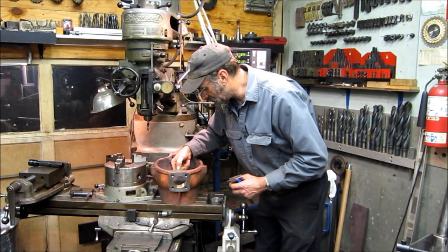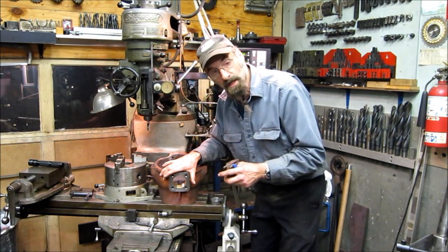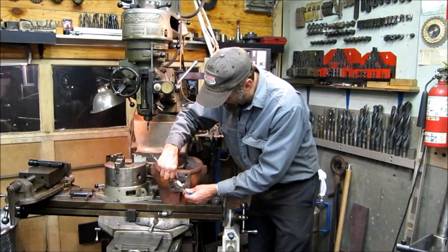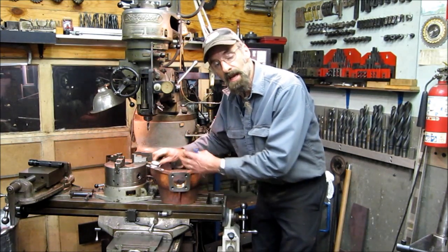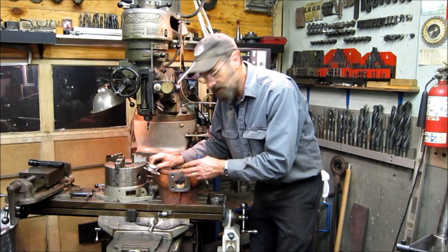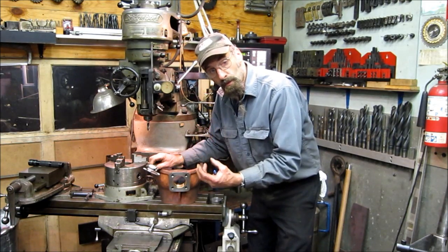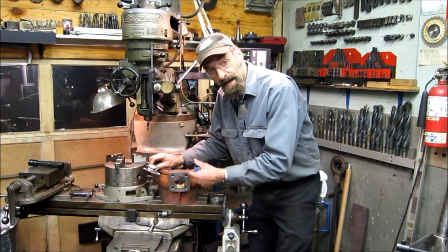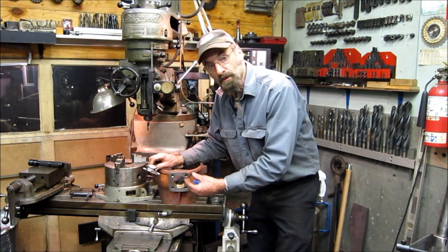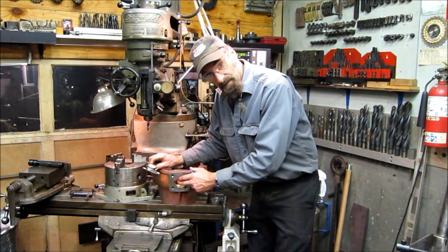The brass actually comes all the way to here and then angles down, so there's very little here. That amount of braze draws just like weld does — it shrinks this side right here and brought that cast into there. I've verified dimensions hole to center and everything else — the hole is within five thousandths of this bolt pattern. There are a lot of braze jobs I've done and I've known from the past that it will draw. I've actually brazed some bores, cut out everything, and back to cast it actually shrunk back down to where the brass was removed. That's why I like to take a little bit more than you think you should take to start with.